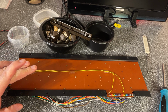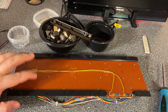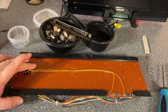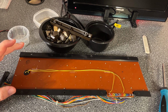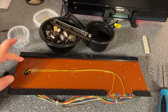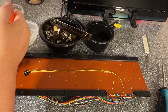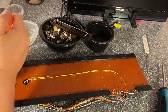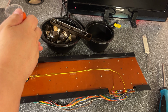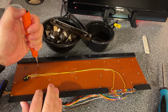So the most probable cause this keyboard isn't working is that the keyboard membrane underneath the PCB is somehow damaged. So I'm gonna take off the PCB and try to clean it. Lots of small screws, but I have a little electric screwdriver. This is quite handy for small screws like this.